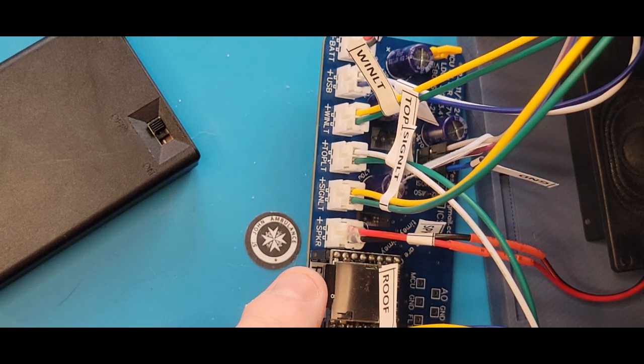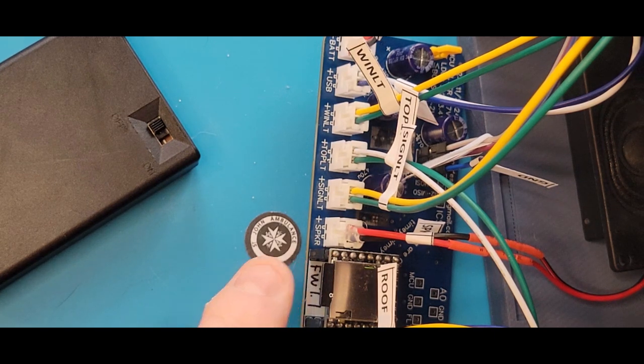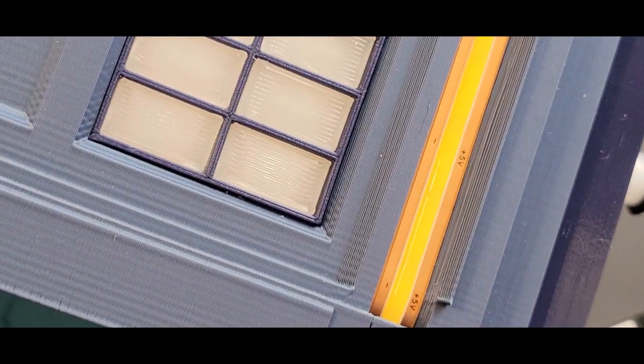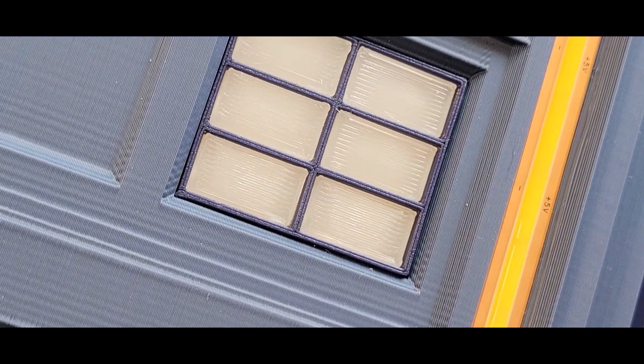But when it's inside the project, it's almost inaudible. And when it's plugged into wall power, it turns on the audio module and leaves it on. So therefore, it doesn't need to initialize each time it's triggered to play. And I've also cut out the 1.5 second initialization time that it needs just by leaving it on when it's plugged into wall power, and that doesn't hurt anything. So I'm going to swing the camera around again so you can see the light action, at least those 2 lights, when I power on and turn on the battery box.